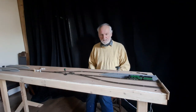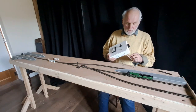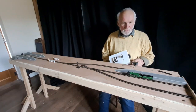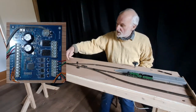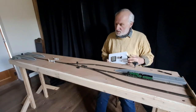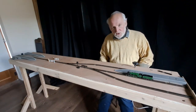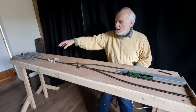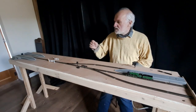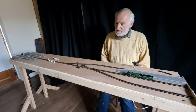Now a quick word about the accessories — the lights and the points. In order to keep the wiring very simple, we just use four wires from the controller: two which go to the track, and those two wires carry the checkpoint information as well. Another two wires supply 12 volts to a PCB underneath here, which is our points and lights PCB. We send the commands down the 12-volt line to turn the lights on — for example, pressing three turns these lights on and three-three turns them off. You can daisy-chain another lights and points board, multiplying the number of lights and points you have. Each board currently does five lights and four points, and you could have another one somewhere else on the system, and yet another one after that. There will be a limit on how many you can use, but that limit will be more than you can probably handle.